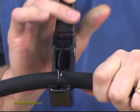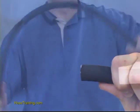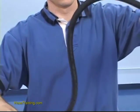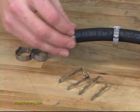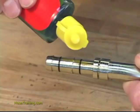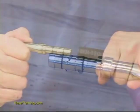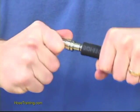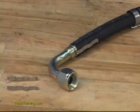Here's how it works. Start with a GH134 hose cut to the desired length. Route the hose in the desired path. Slip two stainless steel EasyClips onto the cut end of the hose — these will be used later. Apply any approved lubricant compatible with the refrigerant to the barb. Insert the barb into the hose. Snap the stainless steel cage into the groove on the shoulder of the hose barb or hose nipple.